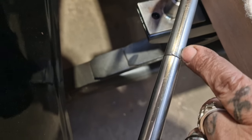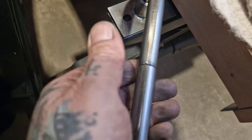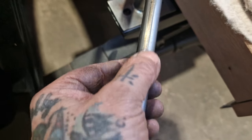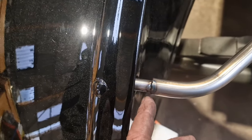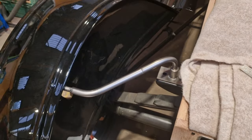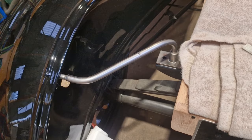Right, so we're there - trimmed up. We've got this invisible join that we've got to finish making. If we line up the seam, then we're bang on. We've ended up with a 15mm shy here - there's not room to take the thick stuff all the way through. So I'm going to make a little vanity ring out of this tube, 16mm long, do an invisible join here and then tack around the end. I'll get that tacked up, get the vanity ring made, and then we'll get it welded up. Should be the job.